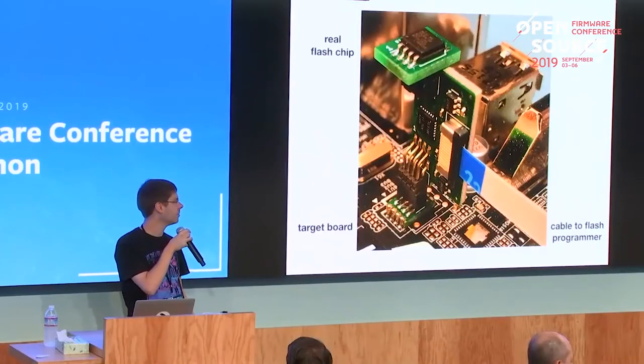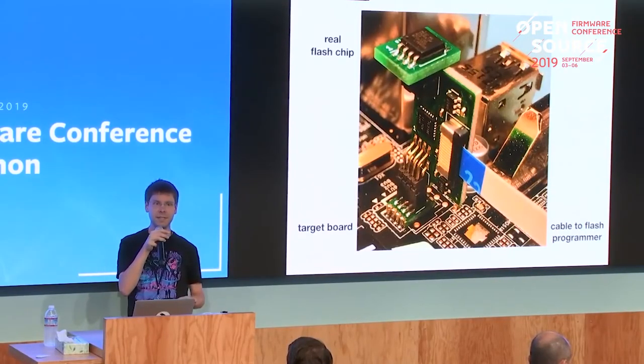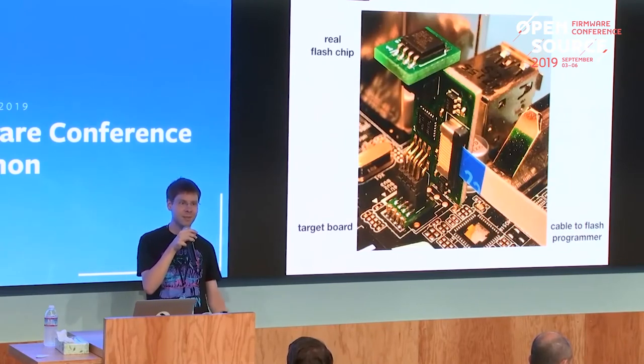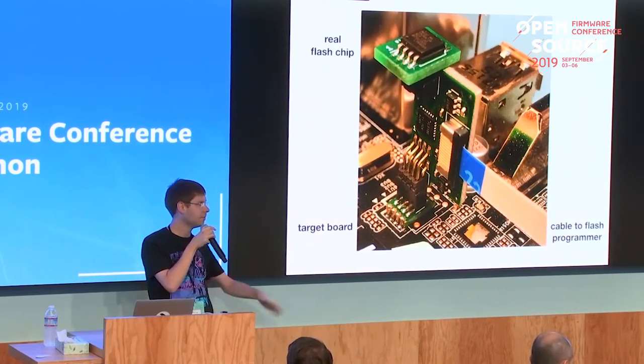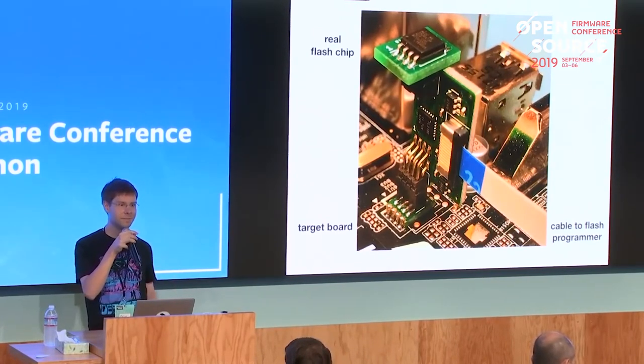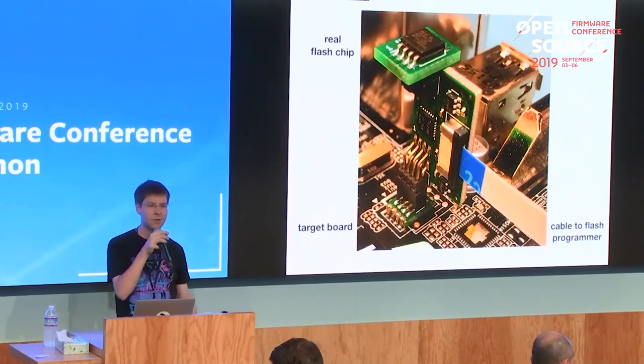because when you put that through a pick and place machine and soldering machine, you can't really glue the parts on the bottom side to the board, because they don't have that much area where you could put the glue, and they're relatively heavy compared to the area where the connector is soldered on the board. So basically, the problem is when you put it through the soldering process the second time, the parts on the bottom side are very likely to fall off. So yeah, I had to do a redesign with components on just one layer.